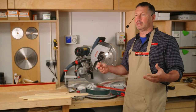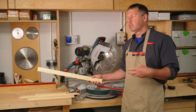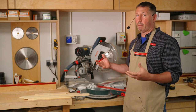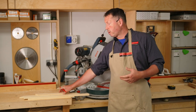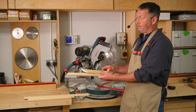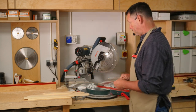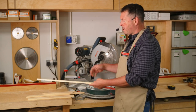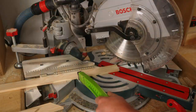Okay, so we're going to frame this piece just with some normal pine, but we're going to put a colour on it as well, probably a dark browny colour. But you can do whatever you want. What we'll do to start with is make the mitres. I've already sized two sides, we're just going to recreate those, and hopefully if we get them the same length and 45 degrees, they should all fit together nicely. So I'll start off by cutting 145, and then I can measure, and then we can recreate the lengths. So yeah, let's have a look.